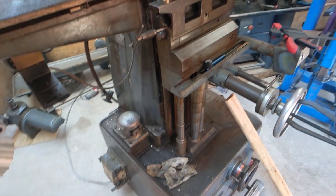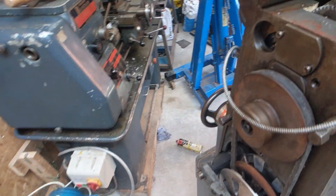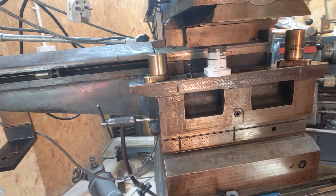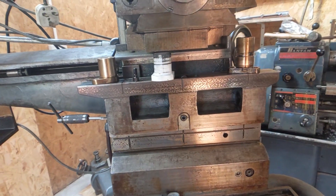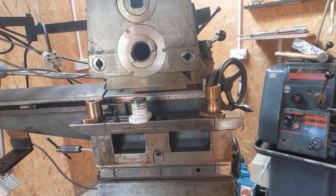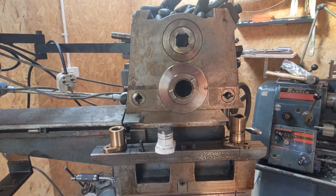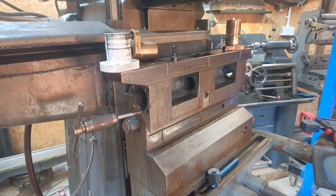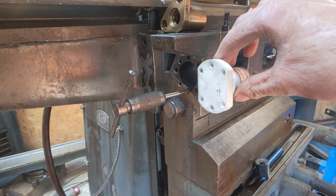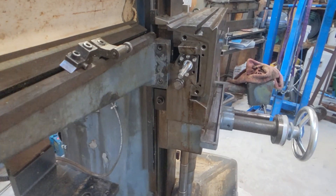As converting my mill to CNC was the only option for getting it working again, I decided to tackle the X-axis first. Both the X and Y looked reasonably adaptable. Disassembly of the 50-year-old machine was pretty good — everything was well-oiled and parts disassembled easily, apart from the X-axis gearbox which had water ingress and was very rusty. There was around 20 degrees of backlash in both X and Y, so I replaced the Acme threads with ball screws. The primary determining factor for the size was the actual bore in the castings where the original Acme nut went.